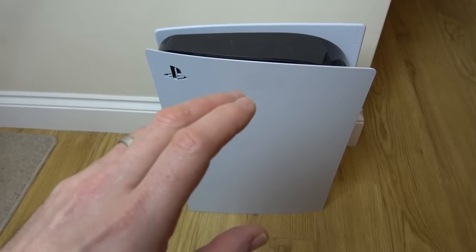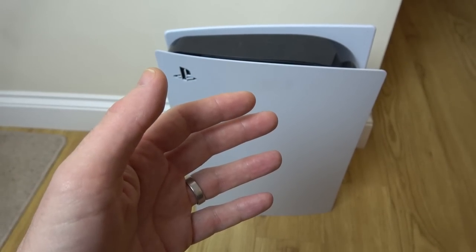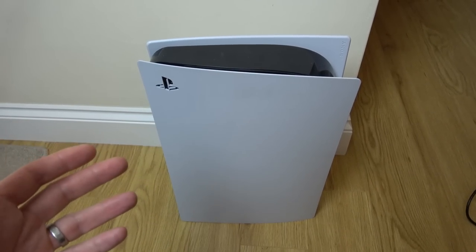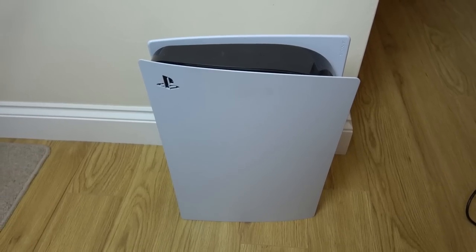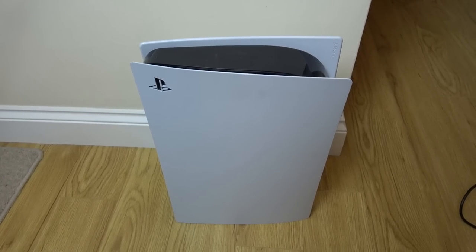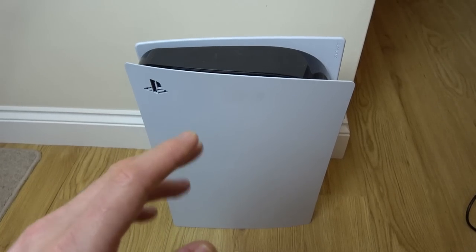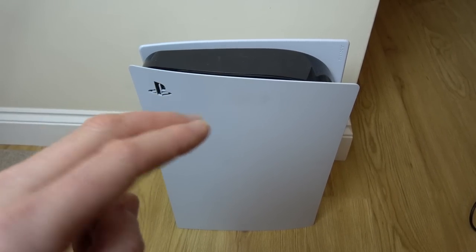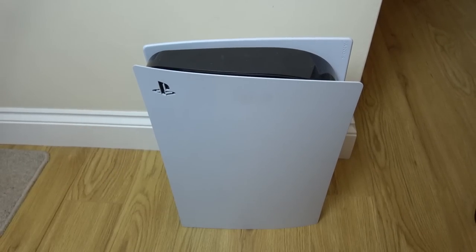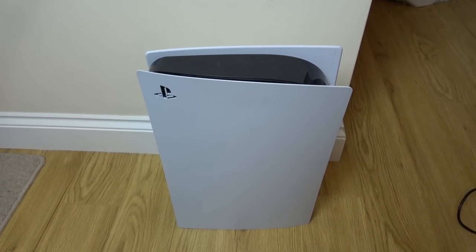For me, it's just really weird how that looked like the honest fault, because capacitors do go short. What on earth's happened to the USB ports? Do you know what I mean? Unless, of course, the original owner thought that's how you get into it or something. It just doesn't make any sense why both of the USB ports were faulty. So put down in the comments what you think. I think it was the capacitor that went faulty naturally, and then the little fire happened, shorted the MOSFET, and sent 12 volts through into whatever that is feeding, and I think the APU and the USB ports have happened since then. But yeah, all very, very odd.